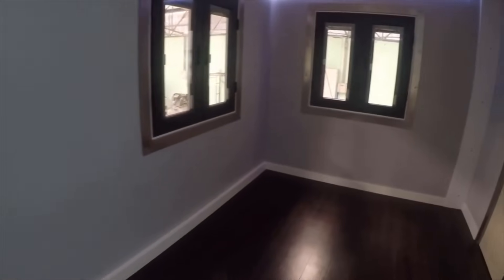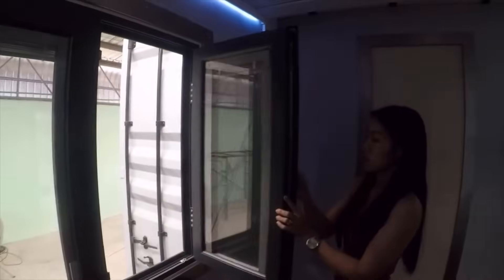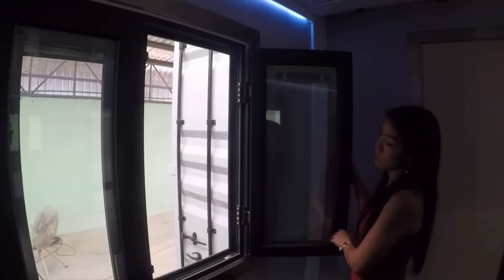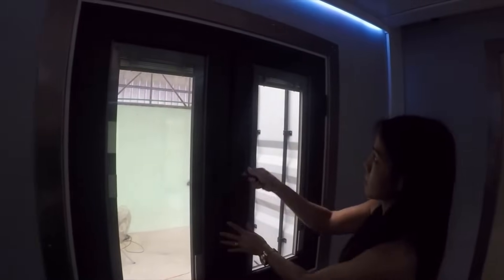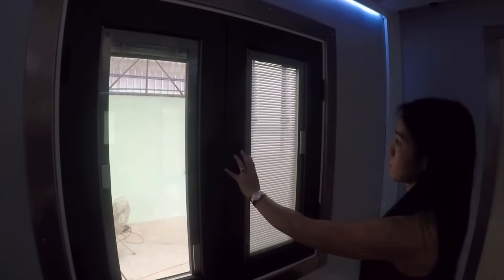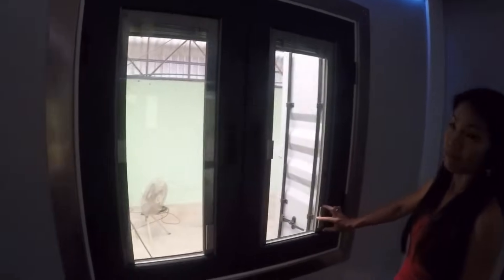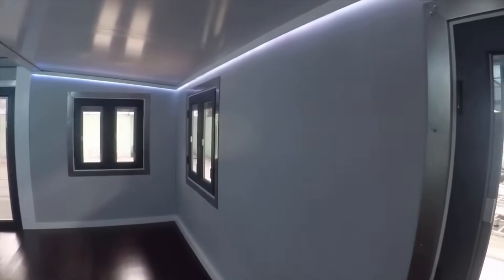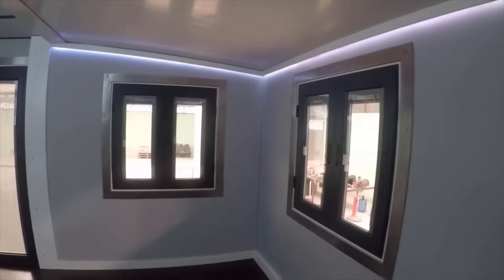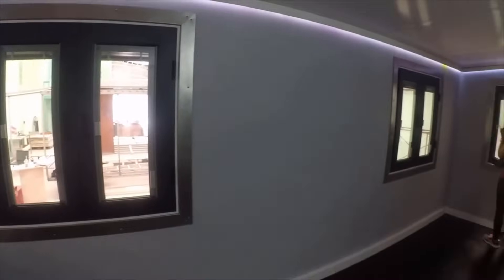You may be wondering about these windows. They are thermally isolated aluminum windows — thermally isolated meaning there's a rubber break between the outside aluminum components and the interior, so as not to transfer cold or heat. They are also dual-glazed with argon gas, and that's right — mini blinds in between the two panes. When these walls, floors, and roof fold up, you can't have anything protruding from those profiles, so handles have to be inset. This whole wall and the windows fold down onto the floor, so you can forget about curtains and rods. Stainless steel is used for all the casings for interaction between the components, and it looks good.